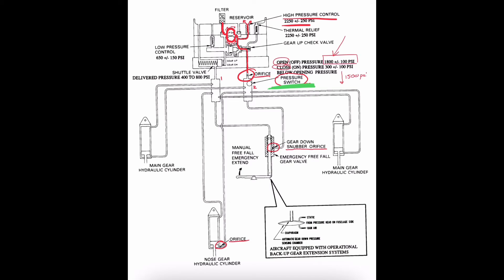This is very similar to the pressure switch protecting the Hobbs meter in a Cessna 172. The pressure switch in the landing gear is basically a monitoring system — it monitors the psi needed to keep the landing gear in the up position, and if that psi is not where it should be it turns the pump on to increase it. If the landing gear is retracted and we still hear the pump activating during cruise flight, there's some sort of malfunction or leak within the hydraulic system and we need to seek maintenance as soon as possible.